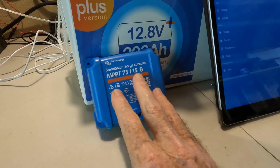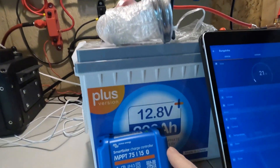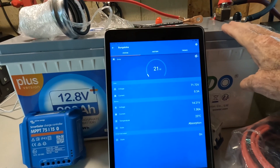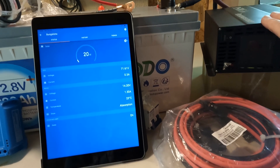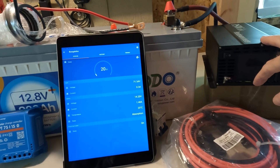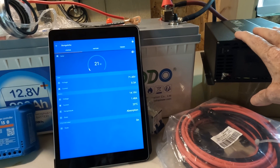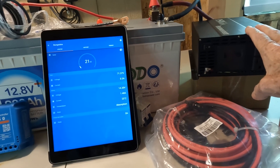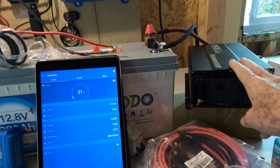On this cheaper one you can do a few hundred watts of solar no problem. If you find you need a little more, you might want to jump up to a larger charge controller, but their prices are pretty reasonable. I'm not sold on any given battery — we've reviewed tons of them and they're all working well. Same with inverters: there are better and less good inverters, but whatever your budget, I recommend pure sine wave inverters for sure, which are mostly what's available now anyway. We used to use modified sine wave back in the day, but stay away from those — for our devices today, pure sine wave is just better.